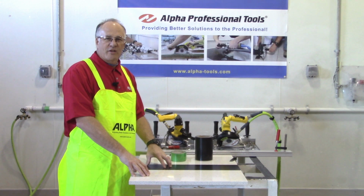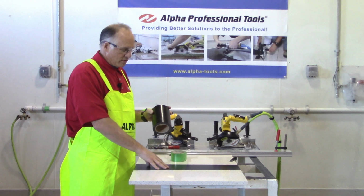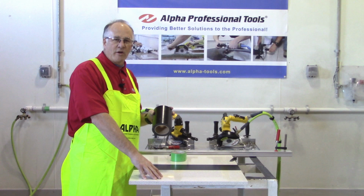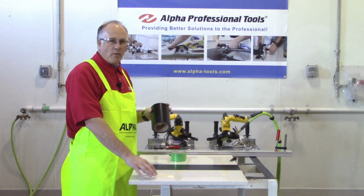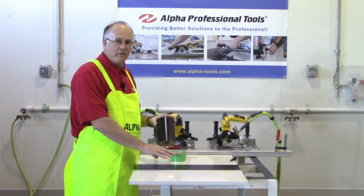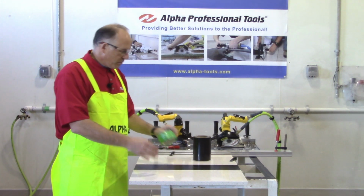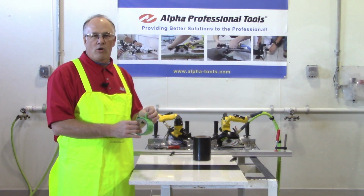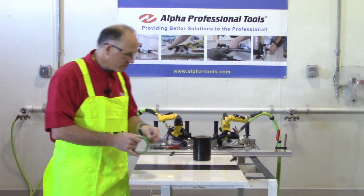Now we're going to talk about surface protection tape. We have a 6-inch roll, which I'm going to use for the guide rail, and also it's going to cover the material, protect from any possible scratches when I'm using the carriage assembly. The reason why I want 2 pieces is to keep the height level together between the guide rail and also the carriage assembly. And then I'm going to use green surface protection tape. This is going to allow me to draw and make my cut line on a material, which I'll be demonstrating.